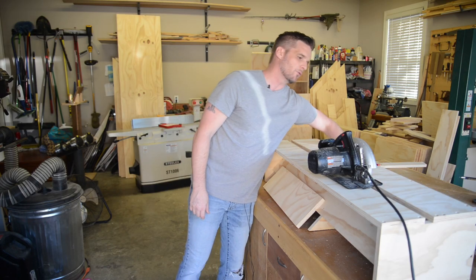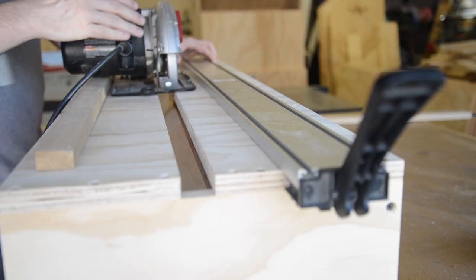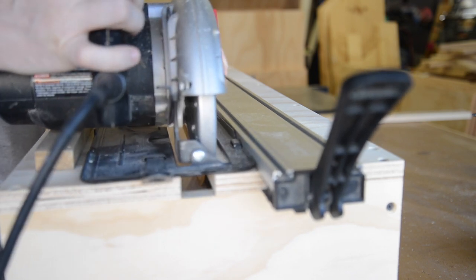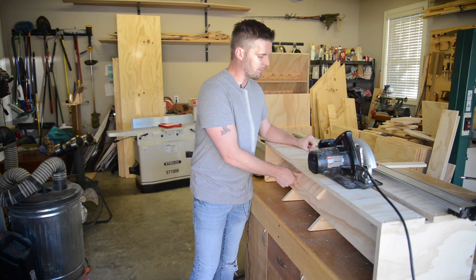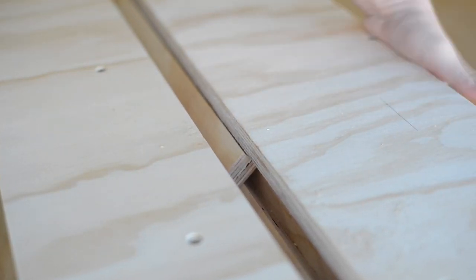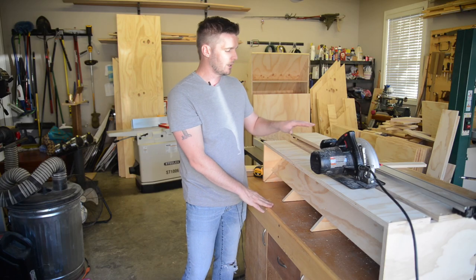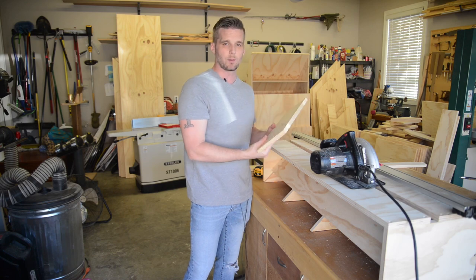Before I attach these guides, the first cut I'll likely make is with this guide, because I need to make sure the circular saw is perfectly lined up so that it cuts on the edge of the workpiece as it registers with the top. Tuning this is likely going to be a little finicky, because I need the ramp to be perfectly parallel to the cut of the circular saw, and also at exactly a 45-degree angle relative to the tabletop, so that when I make a cut, it's even all the way across the width of the workpiece and square to the end.